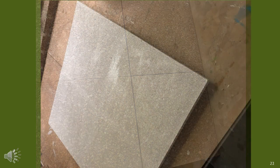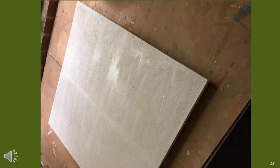This shows the completed 2-foot square cork tile. The gaps need to be filled with wood putty, as do the edges. After this is complete, it is ready for an undercoat. This shows the 2-foot square tile painted, at least with undercoat. It's very important to ensure the edges do not have any build-up of paint. These need to remain as smooth as possible so they can join up with the other tile.